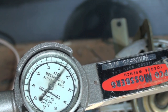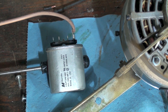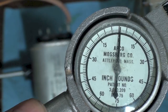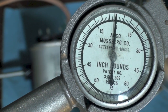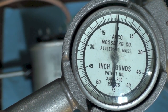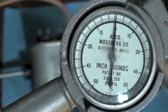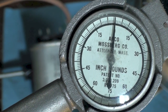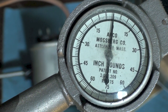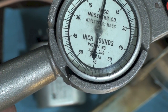Now let's remove the capacitor and see what happens. I've taken one wire off the capacitor so it's no longer in the circuit. Let's see what the torque is going to be without the capacitor. It really doesn't even read — it's maybe half a pound inch-pound of torque, so it's very very low. Also notice on the gauge: we're showing about half an inch-pound, however this is counterclockwise, whereas the motor with the capacitor was clockwise.